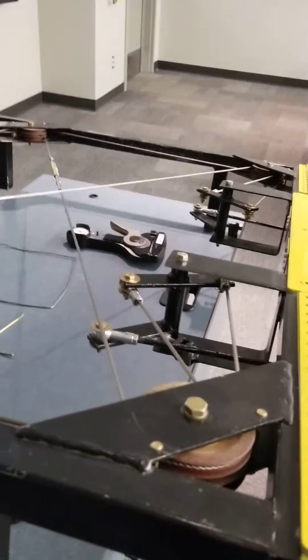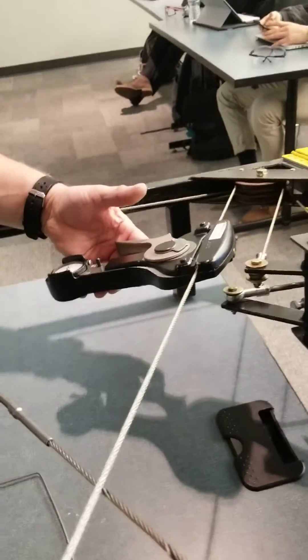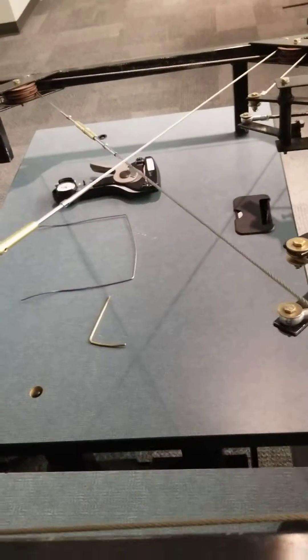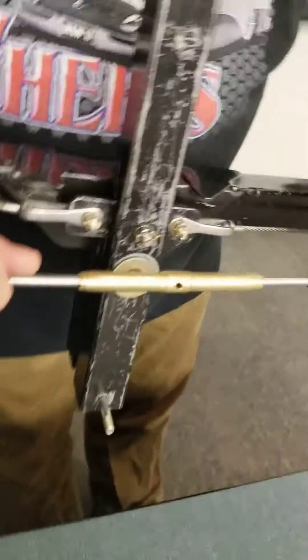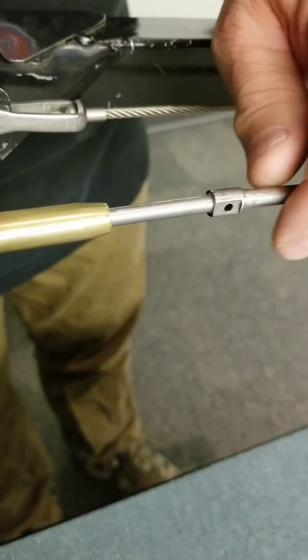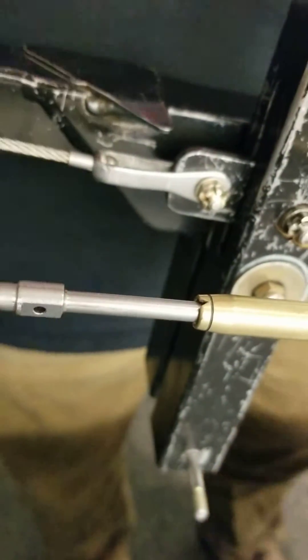That's pretty good — pretty close. So that's how long it takes, about five minutes. Let's check our tension — we're reading 35, holy cow. All right, so we're going to safety this in three different ways. We'll use the safety clips we showed you the other day, but before you can put the safety clips in, everything has to be in alignment. We've got the notch in here and a groove in the turn barrel, so we have to line those up first before we safety anything, because alignment will affect your tension.